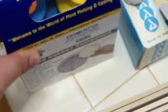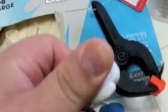You will also need some clay. You'll use clay to base the model when you're doing a half-and-half mold, along with sculpting tools. You will need four right-angled wood panels to make your mold box when making a two-half mold. You will also need rubber bands, latex gloves, and clamps.